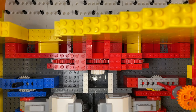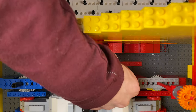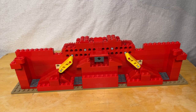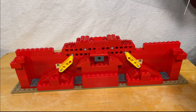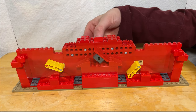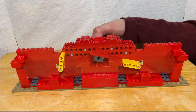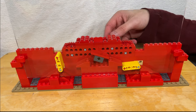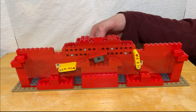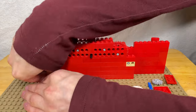Last but not least is the ball distributor. This thing randomly decides which of the four holes to release the ball from. I saved it for last because this is by far the most complicated part of the whole machine. I transplanted it onto another base plate to show you how it works better, and I'm also going to put a sheet of glass in the front so the balls don't fall out. Turning the white gear all the way to the left directs the ball out the third hole. Spinning it a tenth of a rotation to the right directs it out the fourth hole. Two more tenths to the right sends it out the first hole. And turning it all the way right will direct it out the second. Here's what the gears look like in the back, if you were curious — which I'm sure you were.